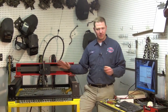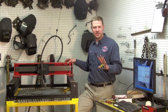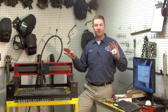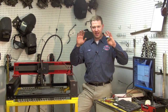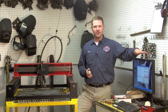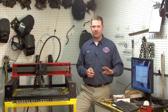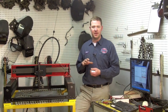I'm going, what the heck is wrong with this thing? So I go back and re-square everything, double-check all the measurements, loosen up the gantry, take it away from the servo motors, and make sure it's moving smoothly and everything's working correctly. Sure enough, everything is square and working fine, but the motors are fighting each other and sounding terrible, just jerking around. So I go to the controller, reload the setup software, configure the motors, and change the direction of them to try and diagnose what's going on — leads to nothing.